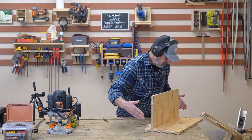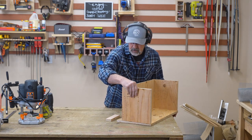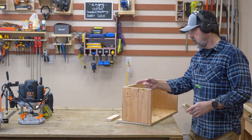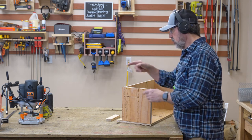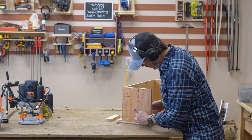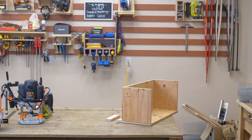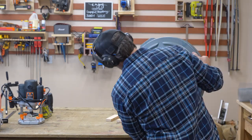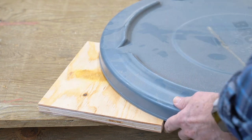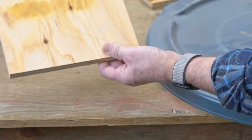Now to build a support that comes down. I cross cut a couple pieces for supports from the back to the shelf itself. I've done it before where I just cut a 45 — that's good — but I want to give it a little more room for the handles so I want to cut a radius in here. I've got to find something big enough to help me with that. Good old garbage can lid — this helped me out on my wedding arch as well. I'll use a jigsaw to cut that.